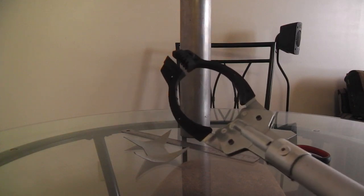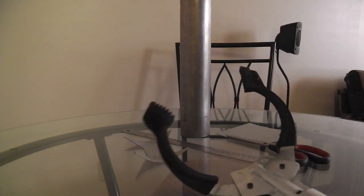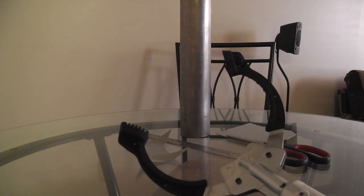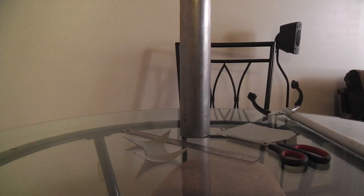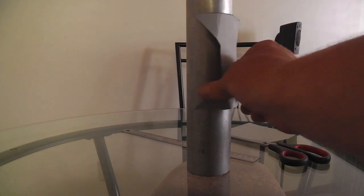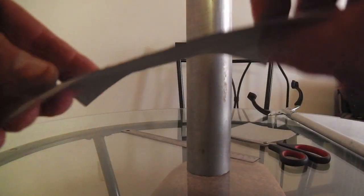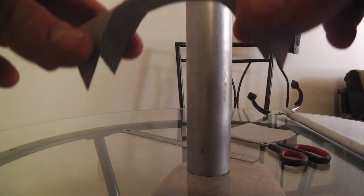Okay. This reacher grabber thing, maybe 4 years ago, I utilized one of these to make a melon picker. And as you can see, right out of the box, that won't pick a melon. But I did utilize some of this stainless steel tubing. I did an exhaust system several years ago, and I still had some extra stock left. I'm making some templates to trace out onto the tubing, and then I'll cut it. I don't have a plasma cutter anymore, so I'm making these lines straight for the cutting disc on my angle grinder. That'll be pretty much how it'll go. I'll arch it a little bit so that it'll just pluck melons.